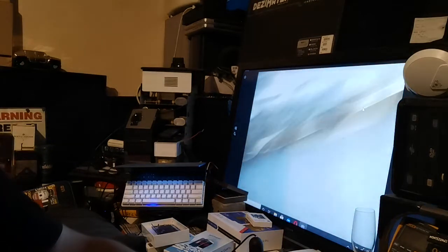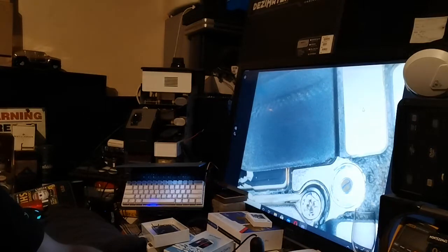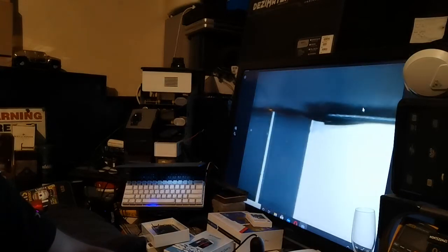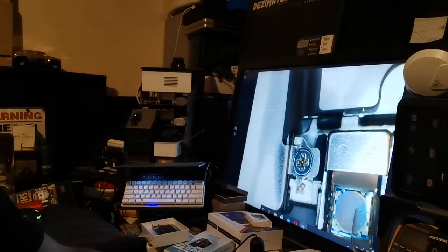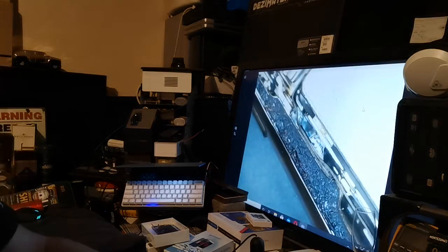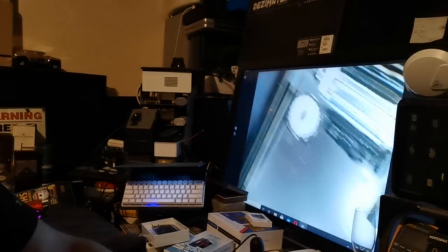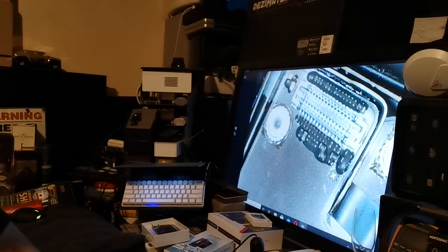It's board separation then. So we're going to need to take that battery down from those tabs under there and pull that battery out. Remove the logic board. Carefully deal with the Face ID and transplant the whole lot into a new casing. That is where our problems are at.